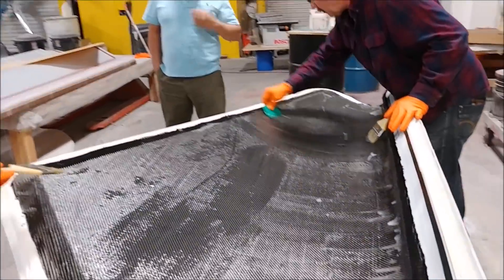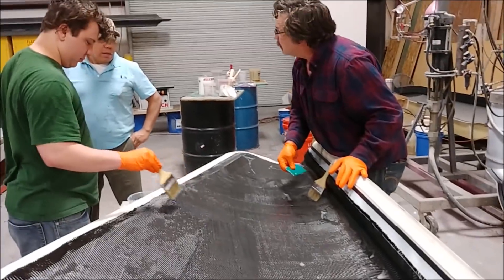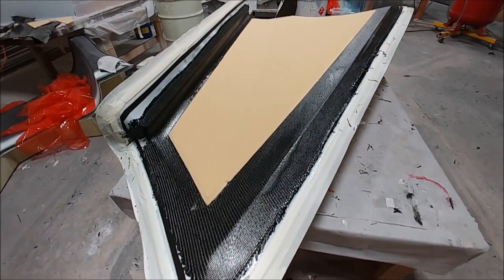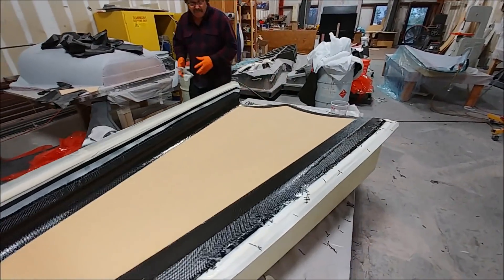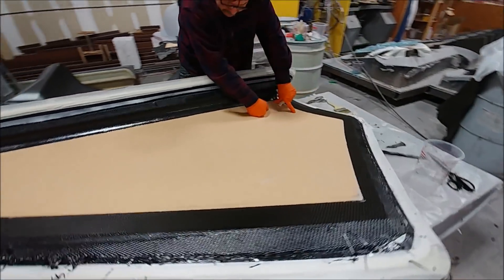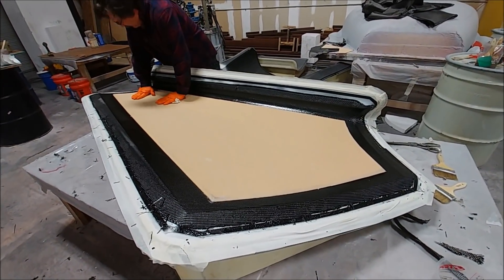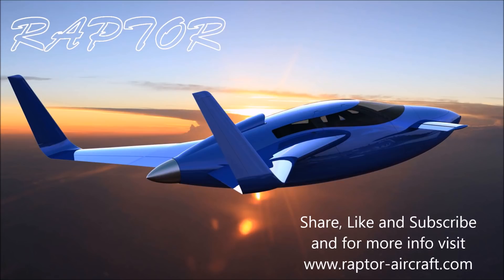Roberto showed up just to say hi and we're trying to talk him into coming back to do some more work for us, but he's so busy at his regular job he just doesn't have time. By end of day, Jeff and Devin had the foam laid down on the second strake skin and were pretty much getting it under the bag as well, so that one will be ready tomorrow for the other side. That's our update for the first half of the week — it's good to be back, and thanks for watching.